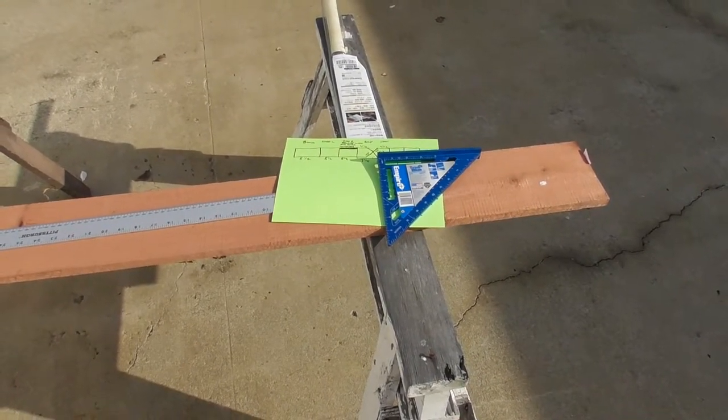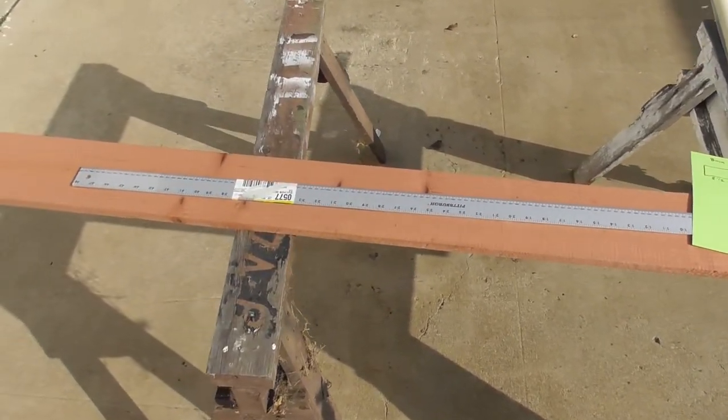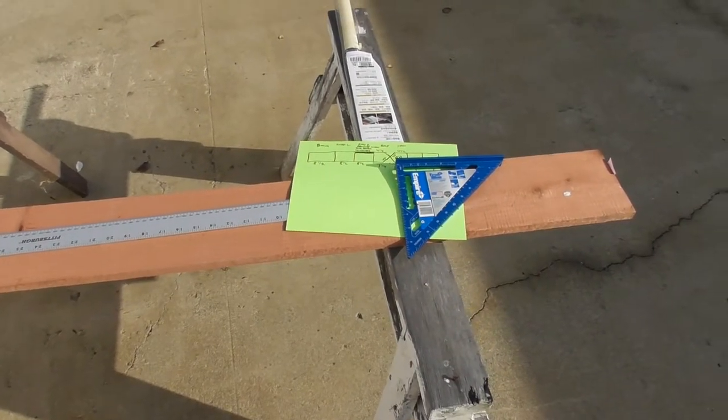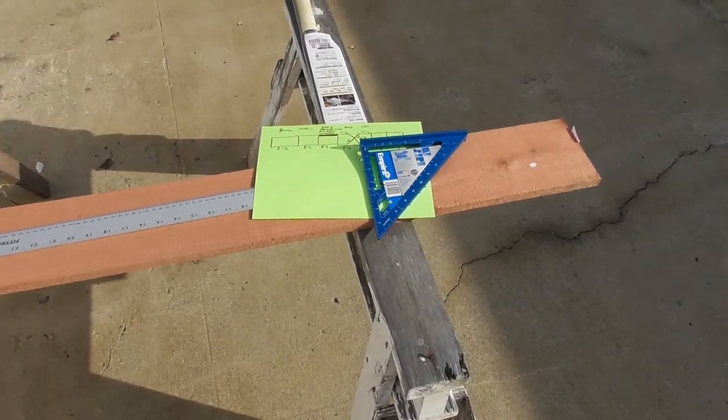You can buy them in cedar, which is very cheap, about $4 for a board like this, or $6 for redwood. You don't really want to do this in plywood or pine, because if it's outdoors, it's going to get ruined within a year by the weather.